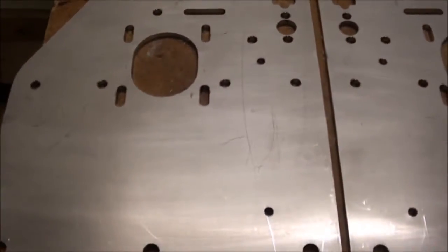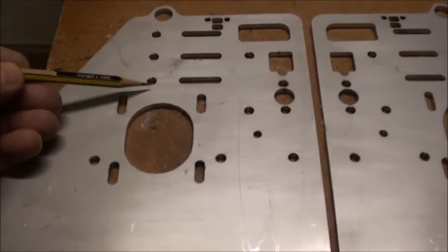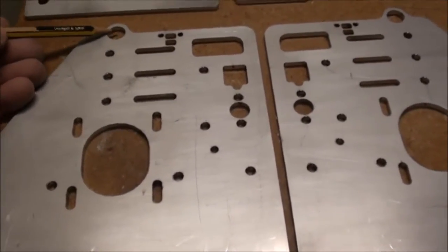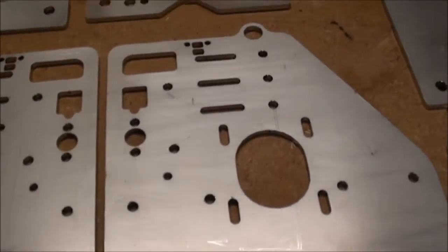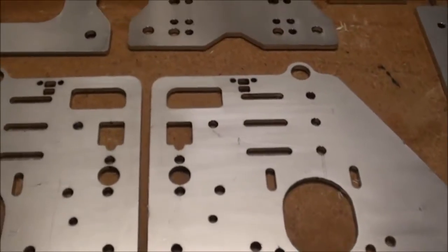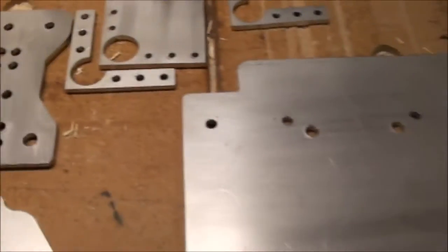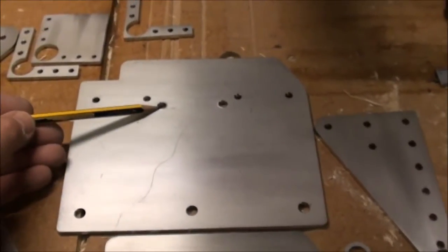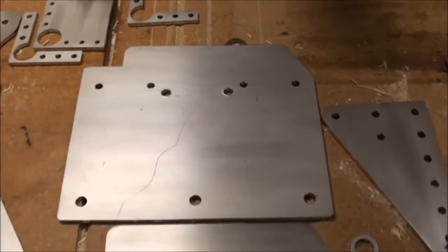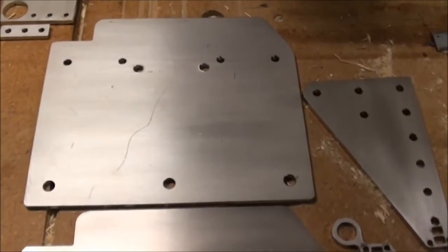What I have done here is I have enlarged this one so it fits the bigger NEMA motor, added some holes, put in the loop for the proximity switch, and added a hole here to pull some wires through. And here we have the inner plates — I added two holes here in order to be able to mount and tighten the motor, because otherwise it's pretty difficult to get to.